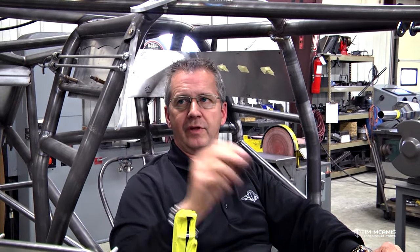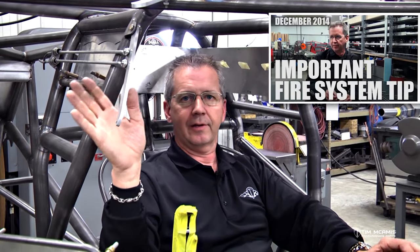If you look back at some of our other videos, we had a maintenance video on these fire bottle cables and how not to neglect them, and once a year pull them out, service the cable and anti-seize it up. Because the last thing you want is to need to use your fire bottles, reach over and grab this, and the cables are locked up because they've been sitting for 5 years and they're all corroded inside, and now you can't actuate the fire bottles. So maintenance on this is critical. This is something that should not be neglected, and it doesn't get used that often, so it's easy to neglect those handles and cables.